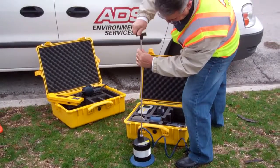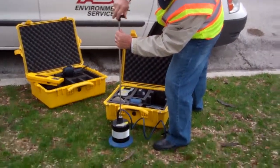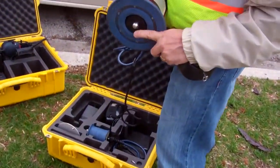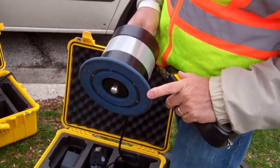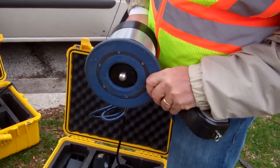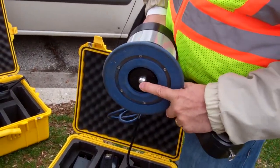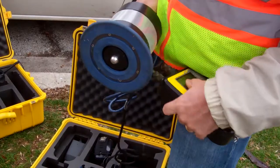So this is the Micron ground microphone. It has a listening transducer on the bottom that is mounted on a rubber bellow, so it's disconnected from the case outside. That's important because it shields it from wind noise. It also has a rubber ring on the bottom to shield it from road noise, so the only thing in contact with the pavement is the actual listening element.